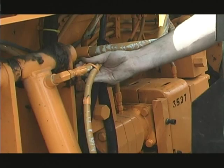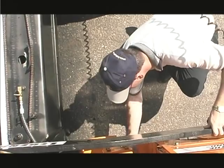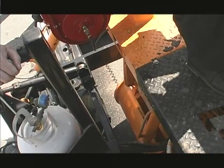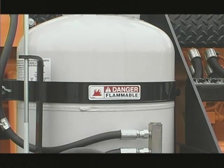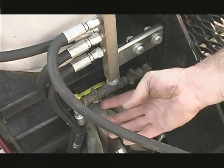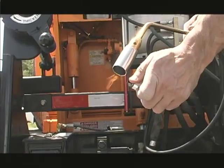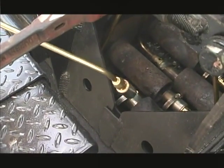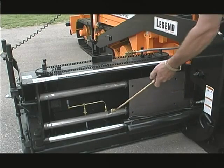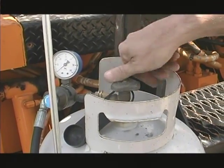When all of the required checks have been properly performed and all necessary safety precautions have been taken, the 8816 paver is ready for field operation. Lighting the burners to heat the screed requires extreme caution as propane gas is volatile and combustible. Before lighting, make sure all of the burner valves are turned off. Then turn the valve on and use a flame source to light the main burners. Repeat this procedure for the opposite side. Use the igniter for each side to ignite the right and left extension burners. After the screed has heated for approximately 15 minutes, turn the burners off by closing the burner valves.